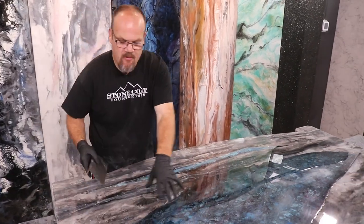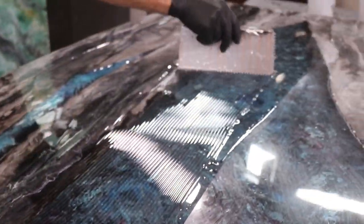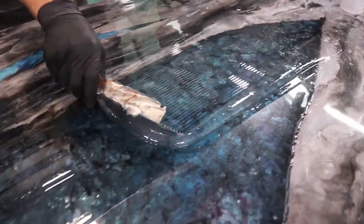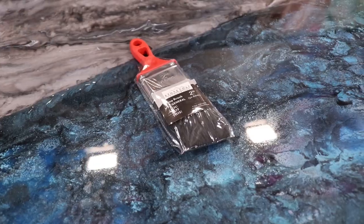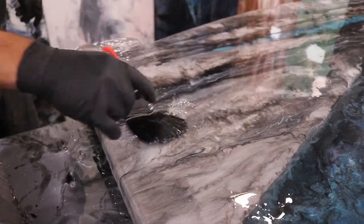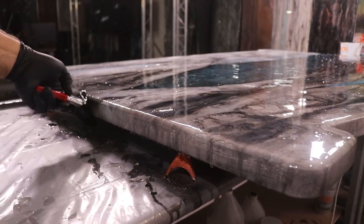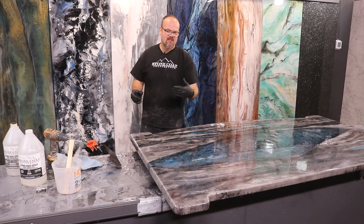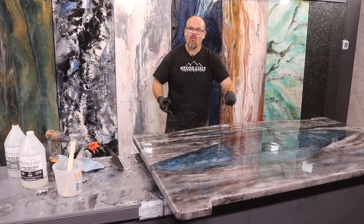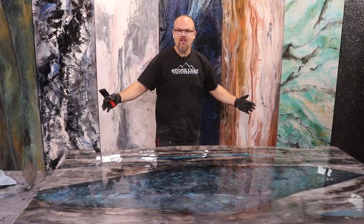I poured all the excess and scraped the bucket. I got this side poured and I'm going to chop it and torch it, then I'll mix the other side — no need to hurry, I've got plenty of working time. I broke this up into two pours. Pro tip: only mix what you can work at one time, then mix another batch and continue. If you have a huge bar running 15 feet long, do it in sections — get that section done and seam it together with the same techniques.